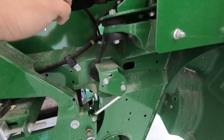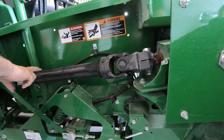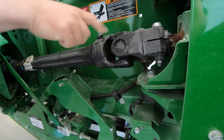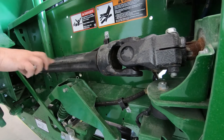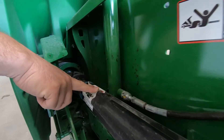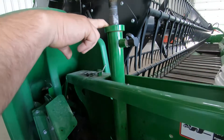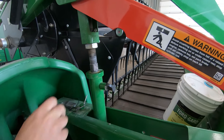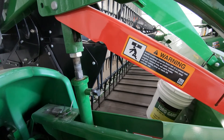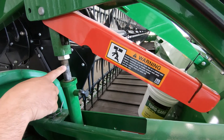Check the seals here on the gear cases. The 6 Series platforms were greasable, but these ones on the 7 Series are maintenance free. The telescoping shaft does have a grease fitting, so make sure it gets a few shots of grease before startup. Just check your reel lift cylinders for wet spots around the cylinders for any obvious leaks, and go through the range of raising and lowering the reel to make sure it lifts easily. You can make adjustments here if required.